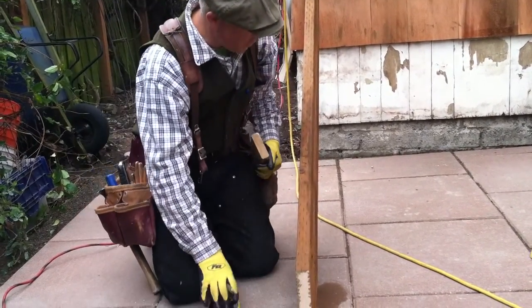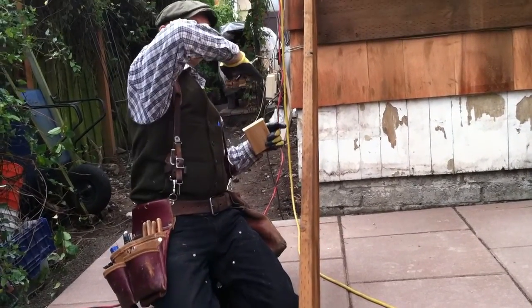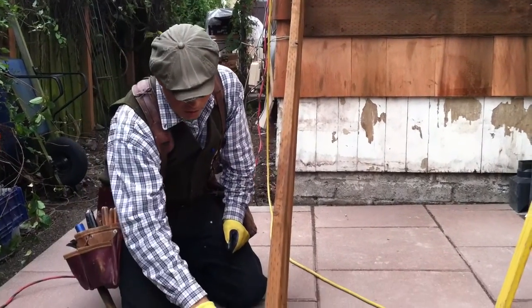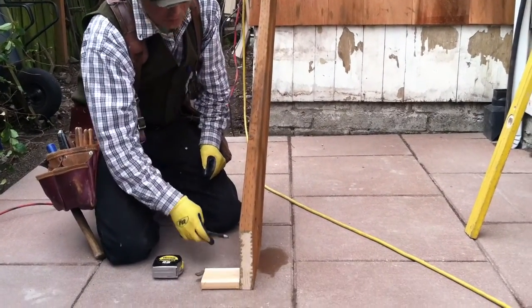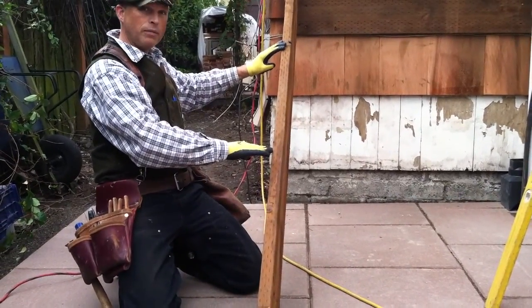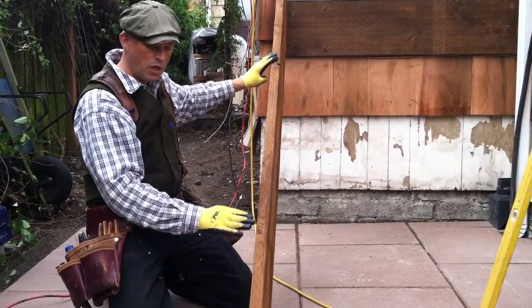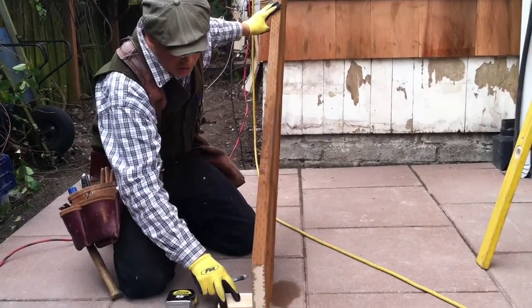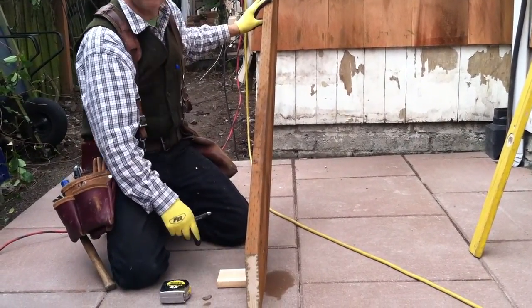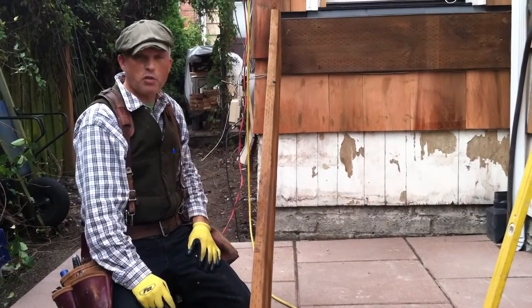So in order to make sure that your treads stay level and are not sloping backwards, you have to take the thickness of your tread off the bottom of your stringers. That will drop this whole thing down, keeping it level. So that's why we always fit this stringer in first, so that we have room for error when we're cutting the bottom of our stringers off.